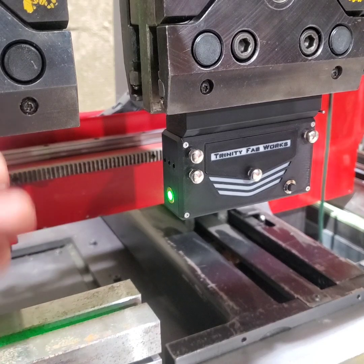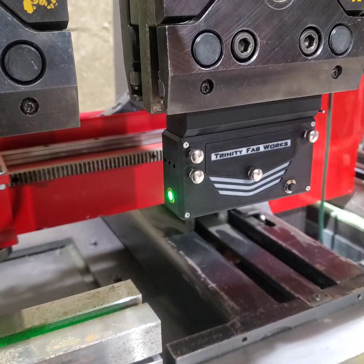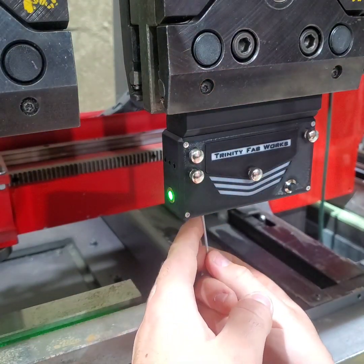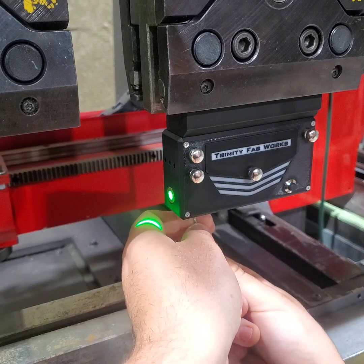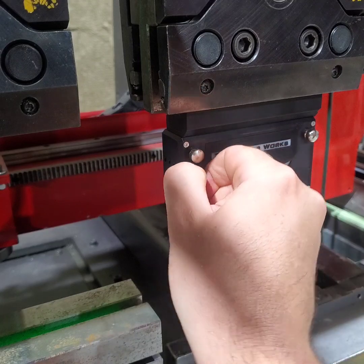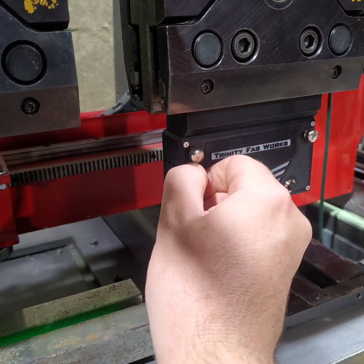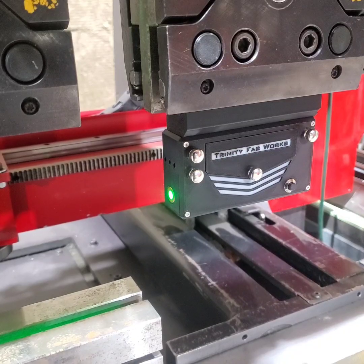Since the laser as my beam goes up and down is going further away from me as it approaches my material, I want to turn this clockwise. But in order to do that I need to loosen up those camber adjustment lock screws on the bottom - they just need about a half turn to crack loose. Now I can turn this clockwise. It can be kind of hard to do and it gets to a certain point where it's out of adjustment, and I'll show how to handle that at the end of this video. I'll run it up and down real quick to check - that will throw my alignment off but we'll align it again later.